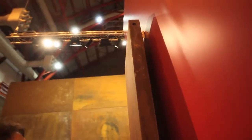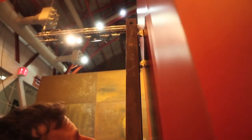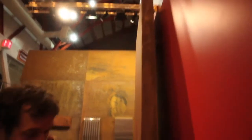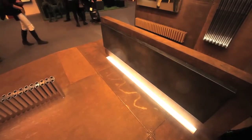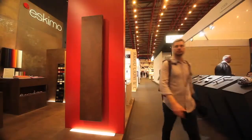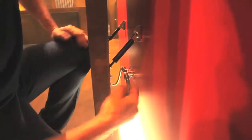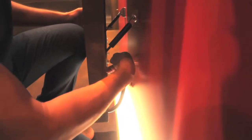You can see the stainless steel hinges that we put at the top of the radiator — that just brings it out at the top. It's available on any of our products from 430mm high, which is this product, up to 2,000mm tall. Each pipe comes out of the wall 200mm in from the side face to the pipe centre, and then 130mm up from the bottom of the radiator to the pipe centre.